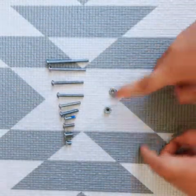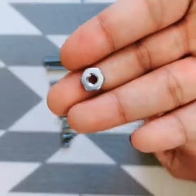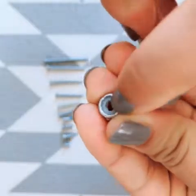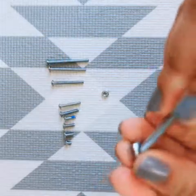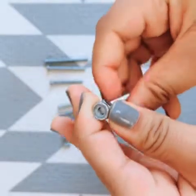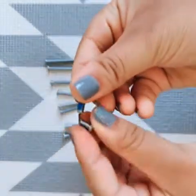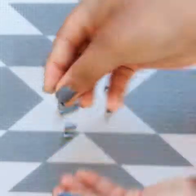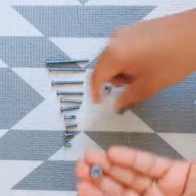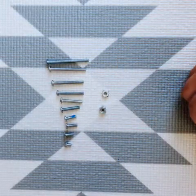So these are bolts and these are nuts. There are many different sizes of bolts, and there are two different kinds of nuts. This is a regular nut and this is a locking nut. The locking nut has rubber inside it, so when a bolt is put through and screwed on, it will only go so far and you would need a screwdriver and a wrench to push it through the rest of the way. For the bolts, these two have a bluish ring around them, which means they have Loctite on them so they have a really strong hold. The locking nut and the bolt with Loctite together give a really strong hold. And that is bolts and nuts.